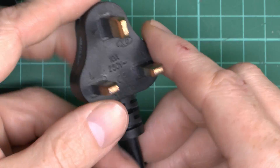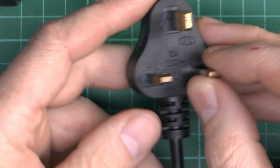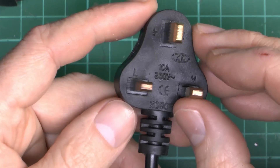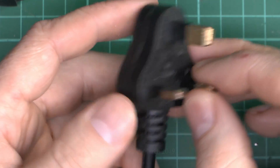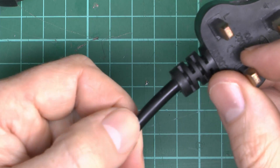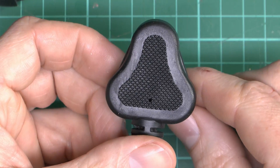This thing does not have a fuse, so essentially the only protection it's going to get will be from the circuit it's plugged into. In the UK that's typically going to be a 32 amp circuit. So aside from this thing not being able to carry 10 amps, even if it was 0.5mm², you could potentially overload it to an extremely high level. And if there was a short circuit, the available fault current is going to be very high, with no kind of protection in there whatsoever.